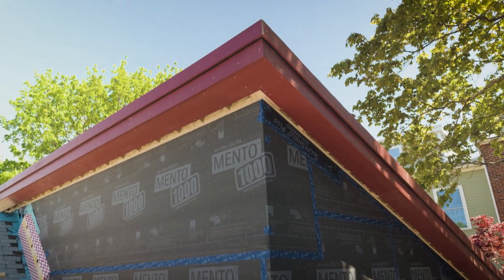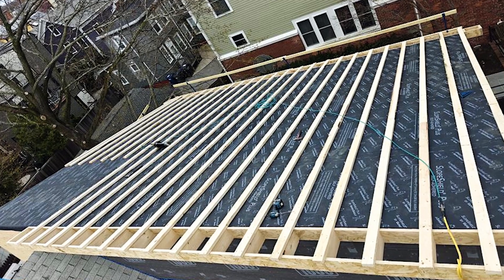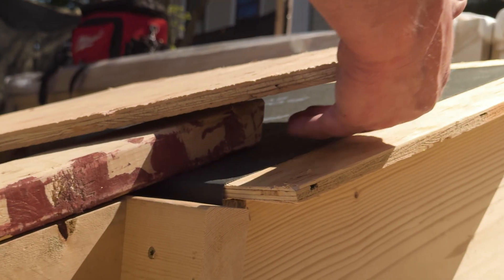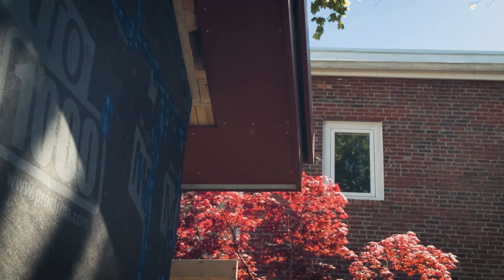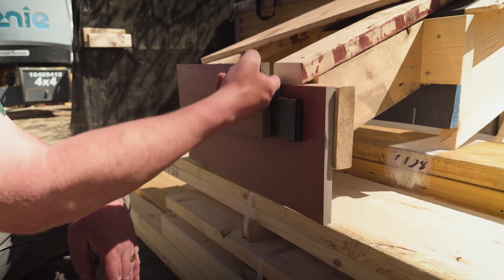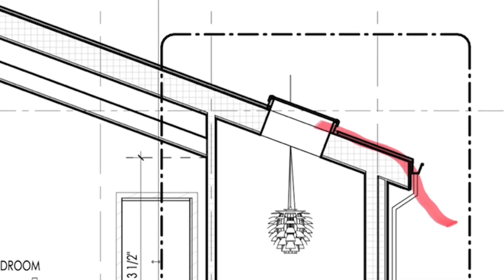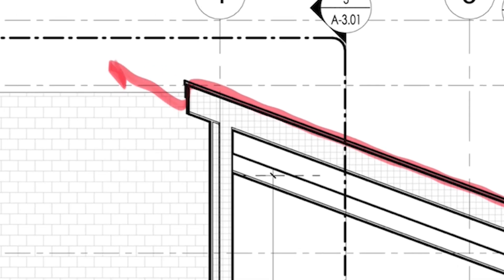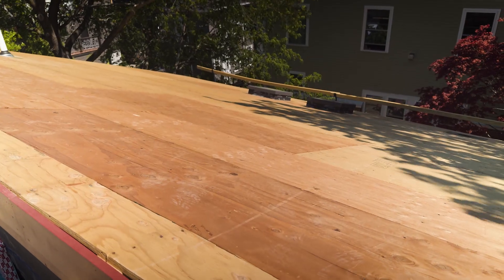And here's the part where we get to eat our cake. On top of that, we have an over-vented roof — we've laid down some 2x4 sleepers on the flat. There's a ventilation channel vented through the core vent on the bottom of the roof line where the gutter would go. You can see the airflow goes up through these ventilation channels and exits on the ridge. The same detail happens in reverse. On top of that, we've got another layer of 5/8 plywood, which will receive the asphalt roof shingles.